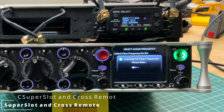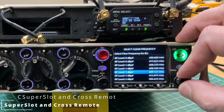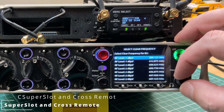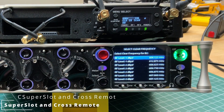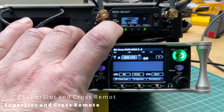There are two versions — high and low — covering 470 to 714 MHz. The display shows the noise level in dBµV starting from zero, going up to 20 dBµV. If it's higher than that, the Sony receiver will not show it as a clear channel — you can still use it, but it won't be flagged as clear. This scan is in group 00, which is TV channel 38 in 125 kHz steps. You can instead choose one of the Sony pre-programmed groups, which always work well together.